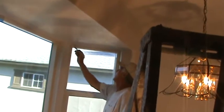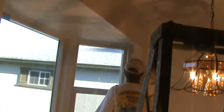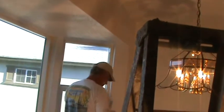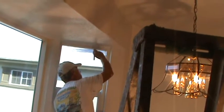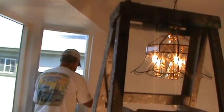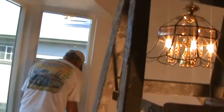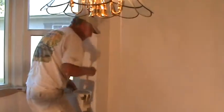Make sure that all the old drywall mud is off the window casing before you even start taping — wipe them all down and make sure you have a clean surface to start with. I got this nicely clean for you — a nice finished clean prep. Prep work is everything. If you came in here and that wasn't done yet, you'd almost feel like you'd have to do that first before you could even paint. You're here to paint today, not start cleaning stuff off around the windows that somebody else could have done.